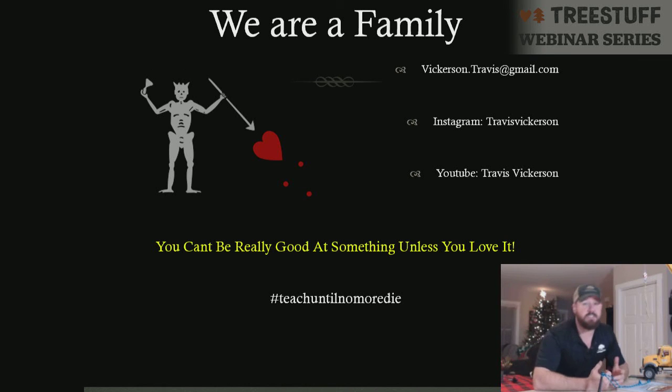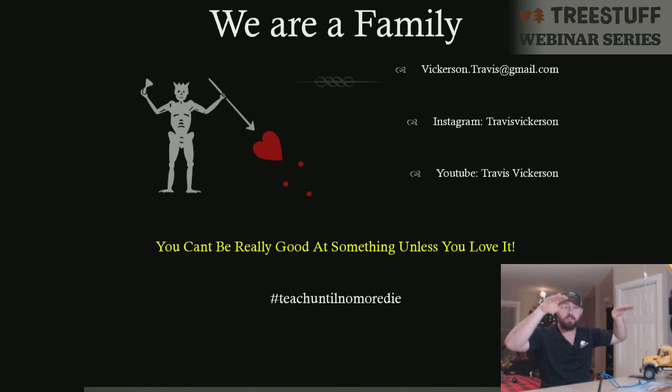I've had really good success with the secret handshake on lots of different types of tree material, be it a very coarse bark material or a smooth bark material. The only time I've ever had any issues is on a beech tree that's got super smooth bark. And what I do there is I take a chainsaw and cut in a little bit of a notch, like a Humboldt notch, on one side or the other for the sling to sit into, just to keep it from sliding or riding up any further. That's the only problem I've ever had. Other people might have had different problems, but I've never seen those problems.